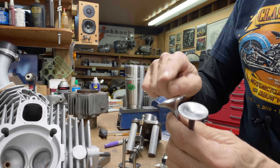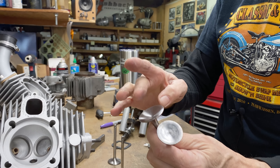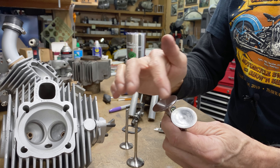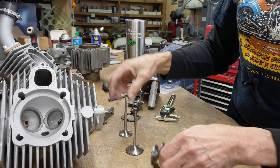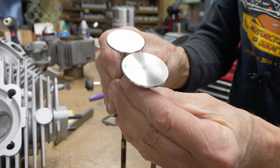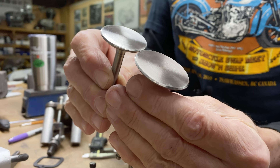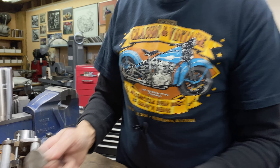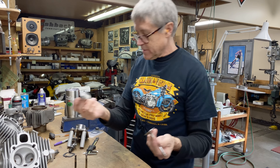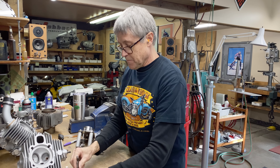This is the fixture I made up years ago. It gets held in the mill on the rotary table and fits up here like this - basically centered in the bore. These rest on top, and this screws into the spark plug hole, then I tighten up the allen screw because I can't hold it from the bottom. I can't hold anything in here because this is getting milled, and then we have to mill down the face as well.